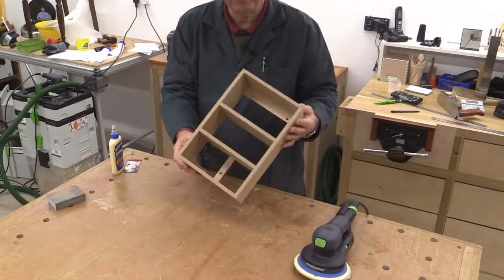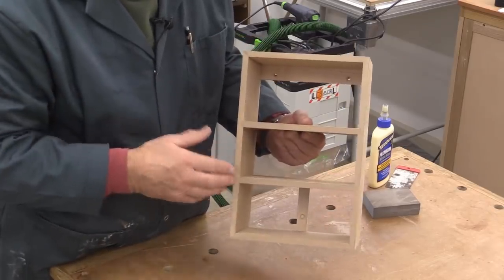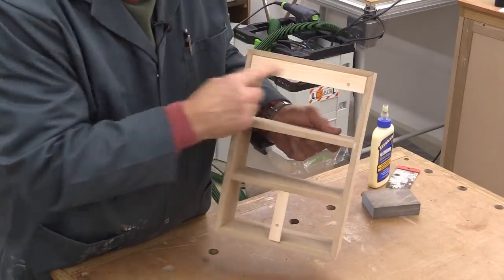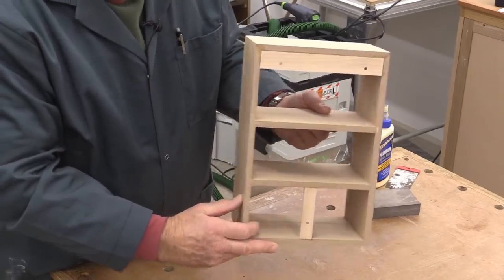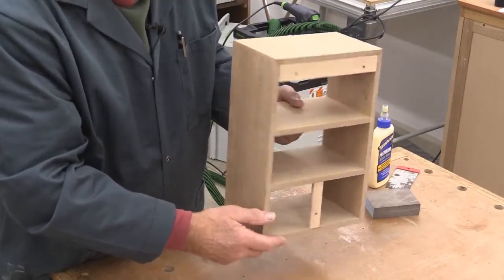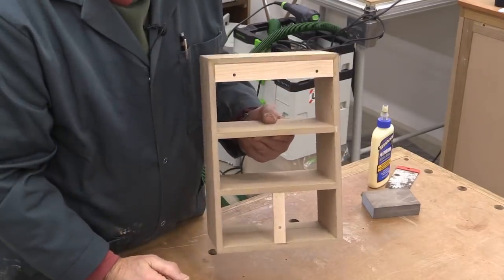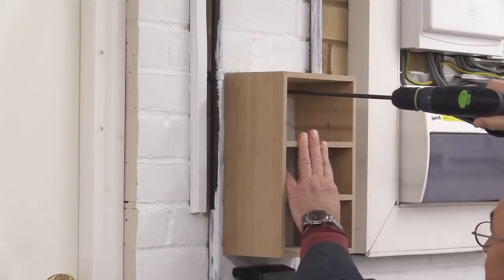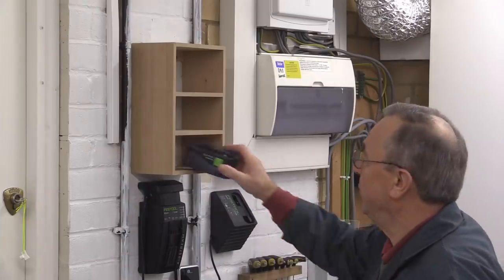If this were a really important piece of furniture you'd try to get the amount of glue such that you didn't get very much spilling out. I'm now going to leave that for the glue to go off for a couple of hours, and then I'm going to finish it off by putting a couple of hooks on here so it can be screwed to the wall. The basic box shelving is there as you can see, and at the back so it can be fixed to the wall I've attached two pieces of wood. One is set in here with two countersunk screw holes, and at the bottom I've got a single screw hole. It will hang from the top, but I don't want the bottom to be pulled away from the wall accidentally, so that's just to keep it against the wall. I'm now going to mark the wall and put in some rawl plugs for these three screws and then fix it to the wall.